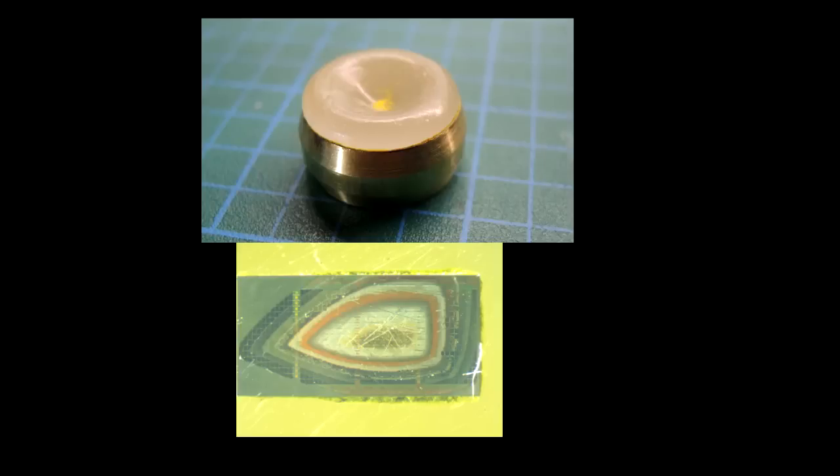Now if you flip the little holder over, you can see that the wax when it cooled didn't cool flat. I poured it flat, but for some reason paraffin always makes these little raised edges, and it seems to correlate with the grind patterns on the other side. We're totally talking about microns between those layers, so this die was flexing an incredibly small amount — unfortunately enough though to keep you from polishing off one layer at a time. So promising, but not quite.